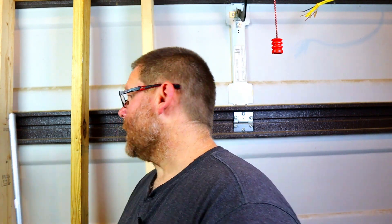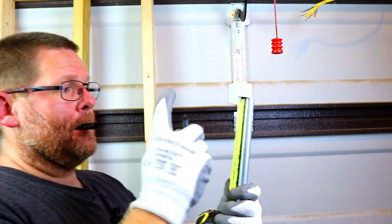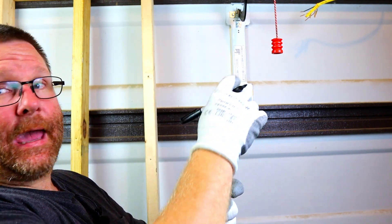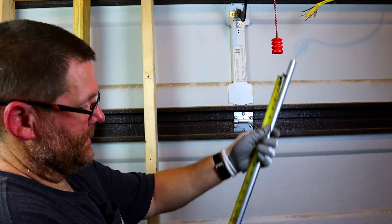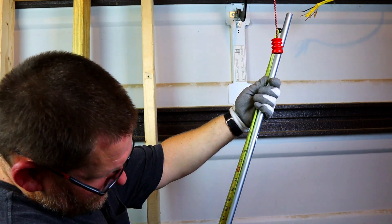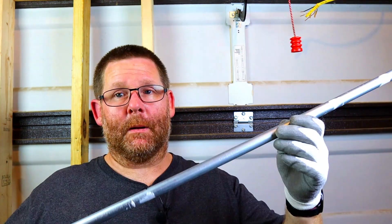We're going to bend this on 30-degree marks. We have 13 inches — actually 13 and an eighth, but for this video we'll use 13. Using 30 degrees, we multiply by 2, so 13 times 2 is 26. On half-inch I always pull at least two inches down from the end first, so if I ever need to cut a little piece off I have that extra. So we start at 2 inches, then come off that mark 26 inches. Now I have my two marks and we're going to pull to 30 degrees.